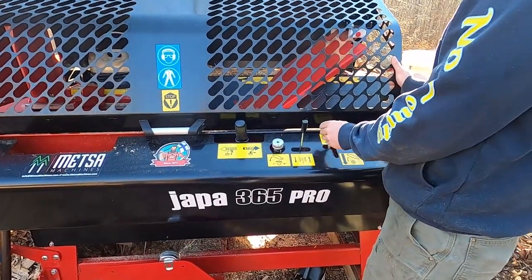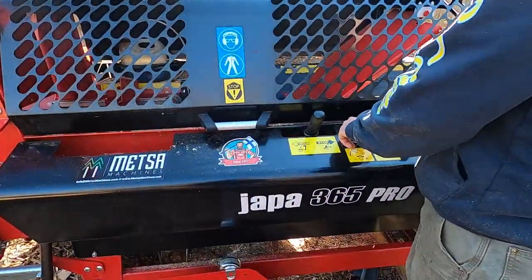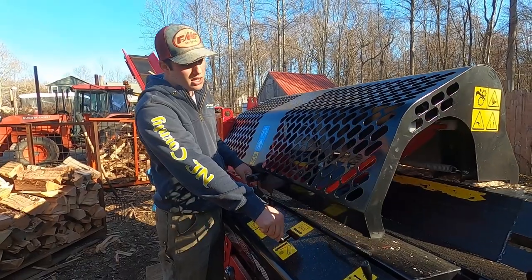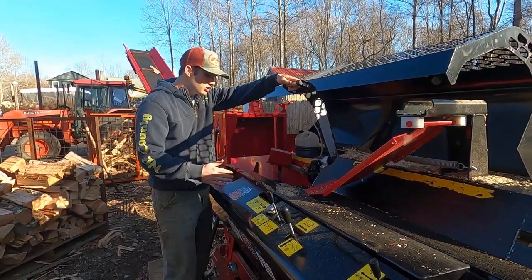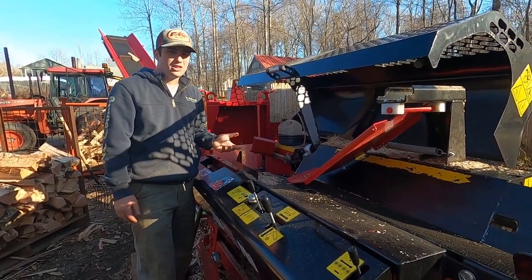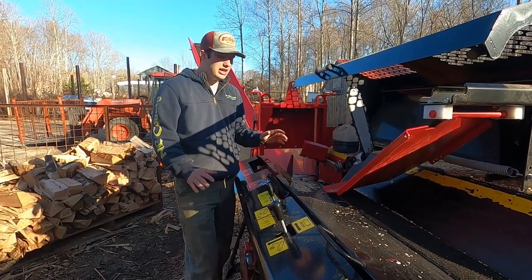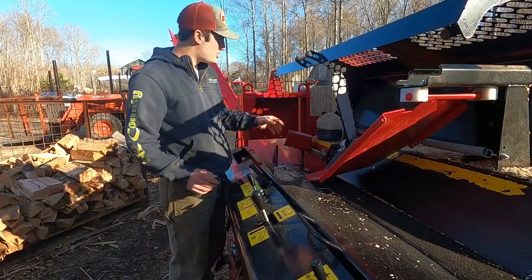When the hood's closed you can do all the controls: infeed, back up the conveyor belt, up and down with the saw, up and down with the splitting knife, and adjust the pressure. When you're feeding the saw down and it lands weird, I keep the saw down, look at where it landed, and if it landed wrong I pick up the hood. The minute the hood gets to that point the saw blade stops, the chain stops, everything stops — including the splitting wedge. At first I was hesitant about this feature and my father and I considered disabling it, but I do not recommend that. It's there for a reason — this thing's right in your face. We thought it was going to be a pain but it's actually super handy; we use it sometimes just to stop and do something in there.